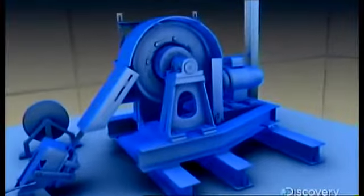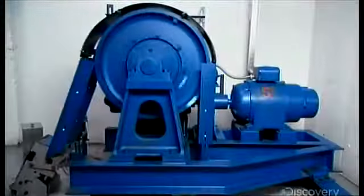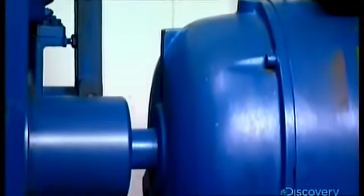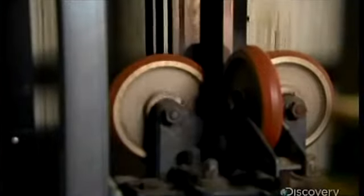The most popular elevator design is the roped elevator, where a car is raised and lowered by steel cables. The machine's muscle lives up here at the top of the elevator shaft. Its ropes attach to the car and loop around a sheave, a pulley with grooves to grip the ropes that's connected to an electric motor. Turn the motor one way, the elevator car goes up. When the motor turns the other way, it goes down.